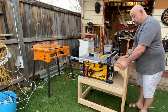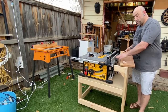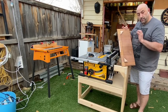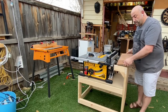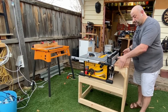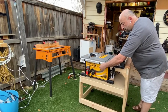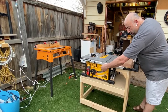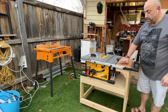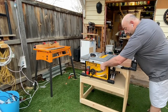And then the way I've designed this is this clips off at the moment. When the router is in place though, I will have a locking mechanism. But this is designed so every time you put it back in place, it goes perfectly into position. Locks in, there's no play this way, there's no play this way. And I've got the minutest of adjustment, probably at 1 to 0.5 millimeter between this and here, and this and here. Okay? But that operates really, really smoothly.